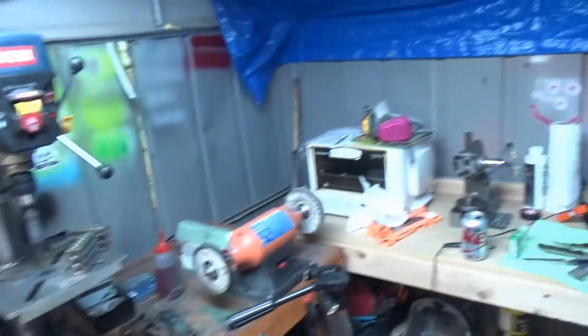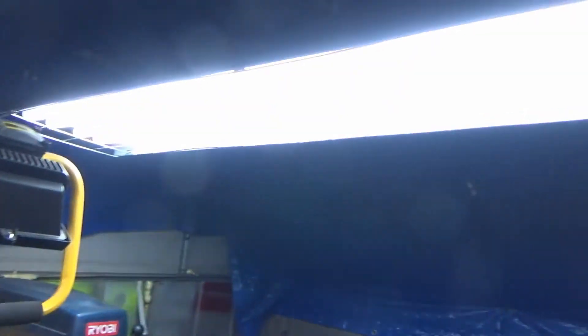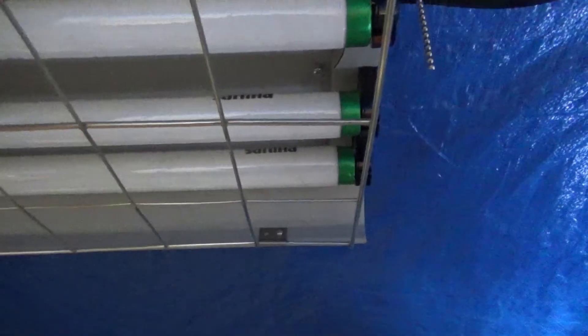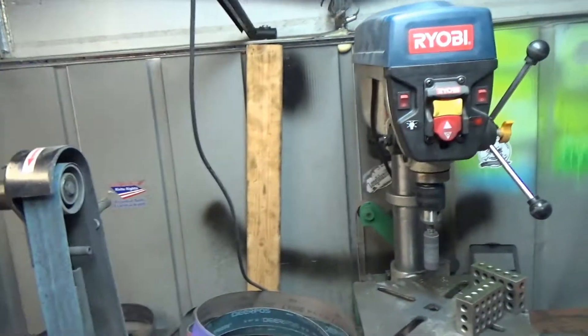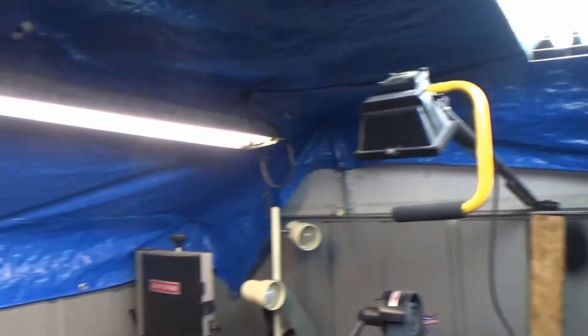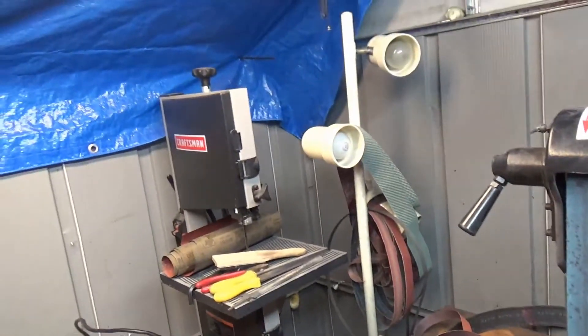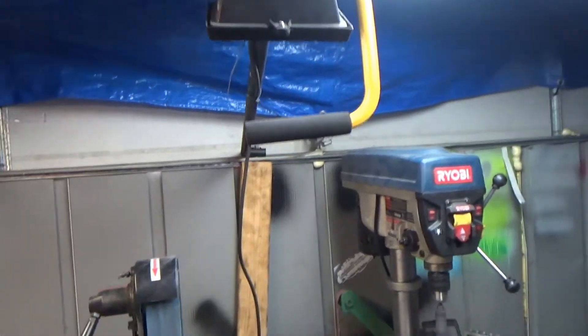So this is critical to light up your hand sanding area — it'll save you a lot of time later on. Now this is a little 8x10 shed, and I have these two big fluorescent lights. I just picked this one up from Home Depot — it's the one with the cage on it, and they're 50 bucks for this fixture. It holds four fluorescent lights. Now you want to get the Philips Ultra Daylight Bulbs — they're the brightest bulbs they have. You can see, that other one is more of a yellow, but this is a super white. Get those particular bulbs; these fixtures are great. For 50 bucks they have an outlet in the back so you can string them all together if you have a bunch of them.